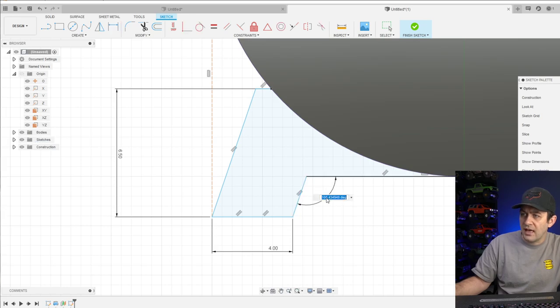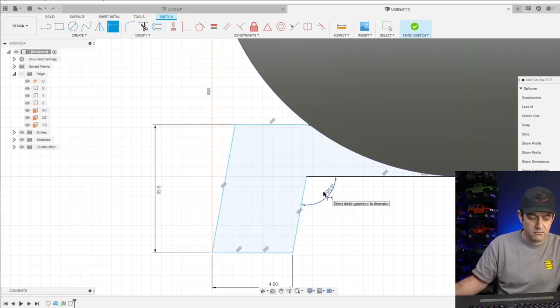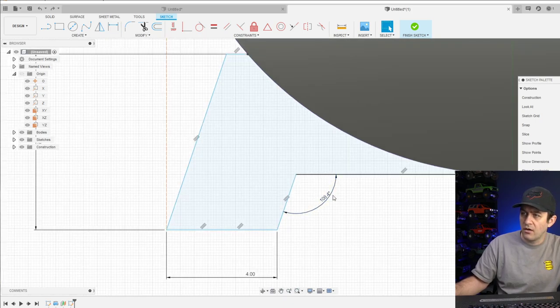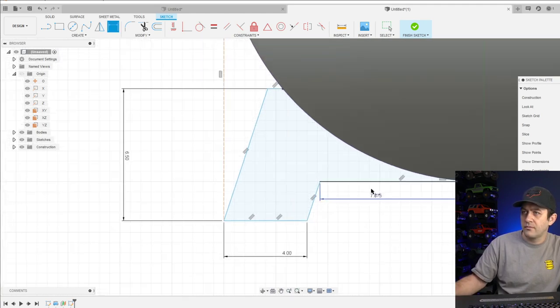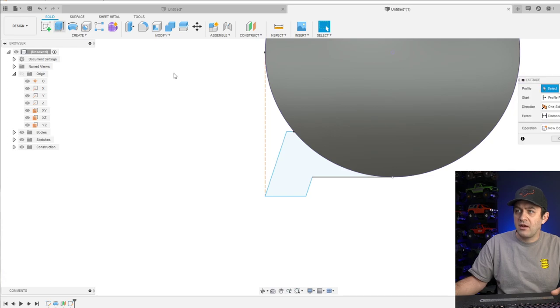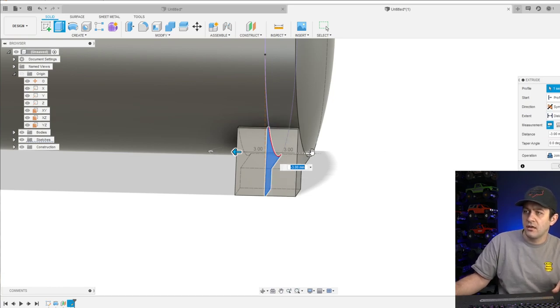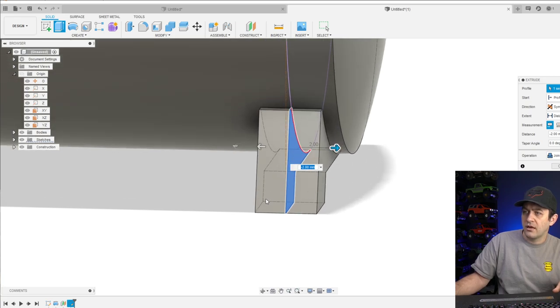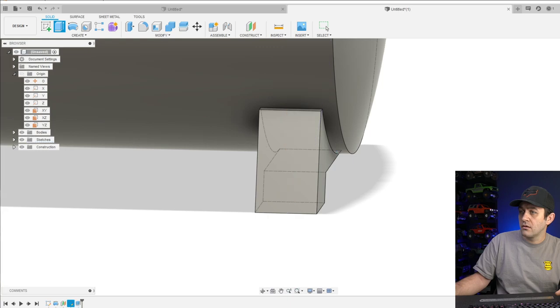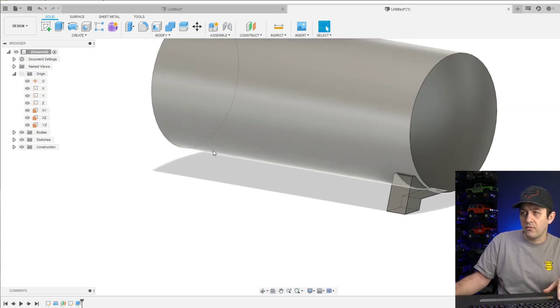These little hash marks are parallel constraints — certain lines are parallel to each other, so if you move one it moves both. These are called constraints and they're super important to drawing. If you get in the habit of using constraints early, your drawing adjustments will just be so much more smooth. Let's make the overall height of this leg 6.5 millimeters — that keeps it pretty much in check. We'll do symmetric so we get a two millimeter width, giving us a four millimeter wide foot — a square pad on the bottom.